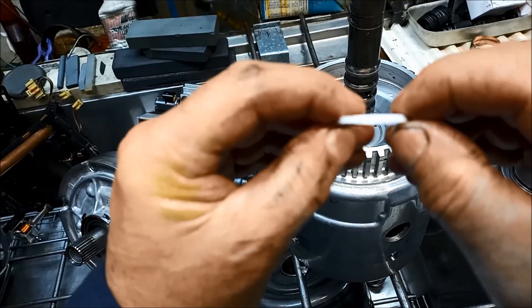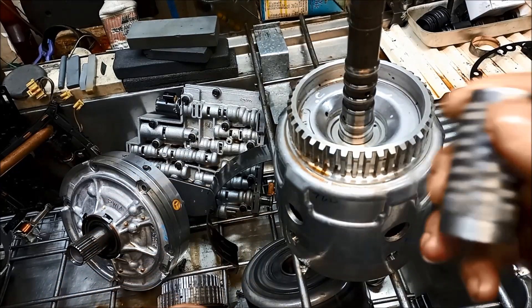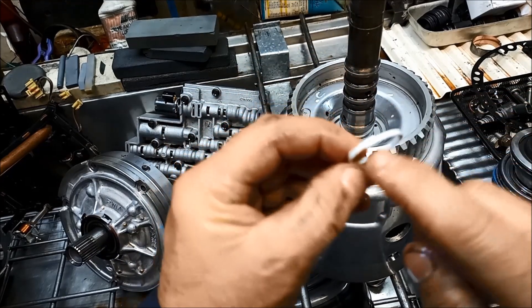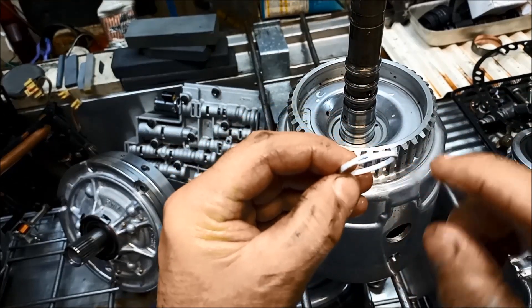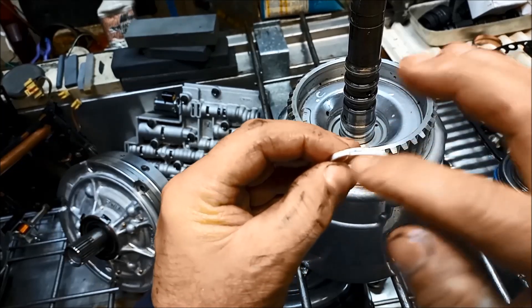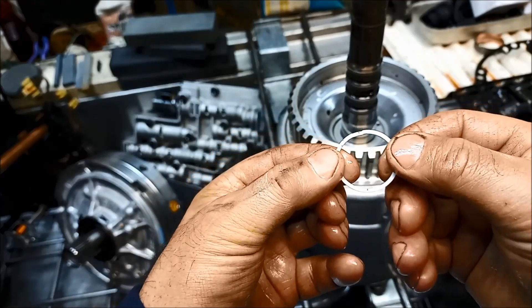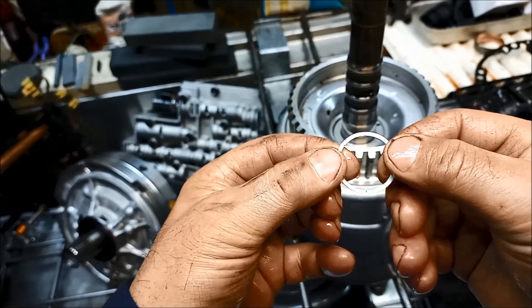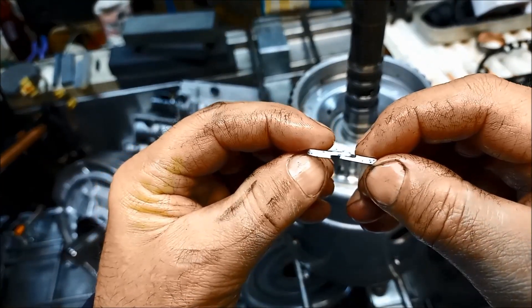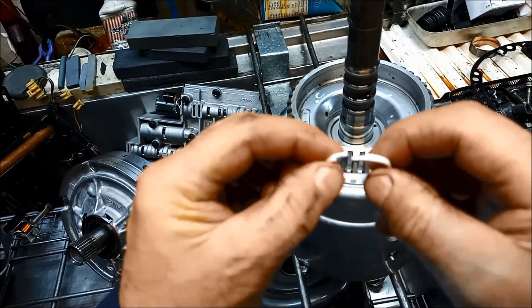These have a little step cut in them. The beauty of it is you don't need a shaping tool. Whenever you get pressure coming in, it'll actually push that ring outward to take up any slop or wear, even if the bushes are worn. You can see it can expand all the way up before it stops sealing — you've got that step, it'll go all the way there, meaning they'd have to be completely destroyed before they leak. So they'll never actually leak.